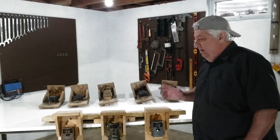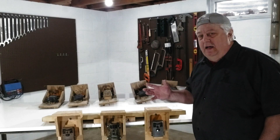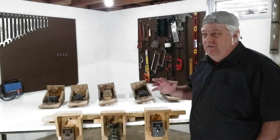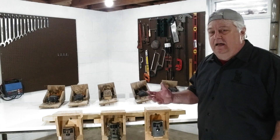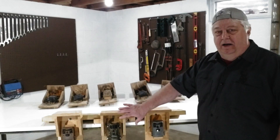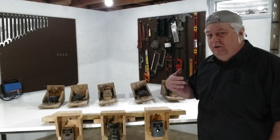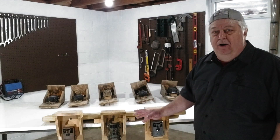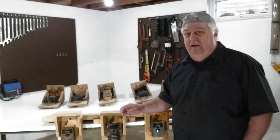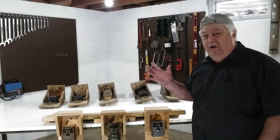The first thing you want to do with these game cameras is the setup — it's important. One thing you've got to watch out for is which way the sun is coming from. You want to point the cameras somewhat north and south rather than east and west, because east and west you're going to get the sunrise and sunsets — that really messes with your video quality and pictures. If you can face them north or south, that seems to be the best direction. The other thing is you don't want branches in front of it, because a branch waving in the wind will set these things off and you'll have a hundred videos of a branch swinging with no deer on any of the pictures.